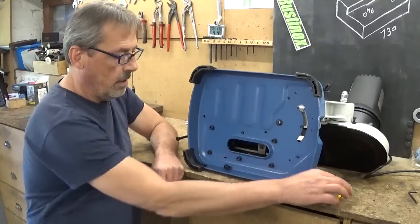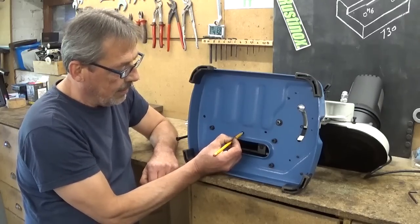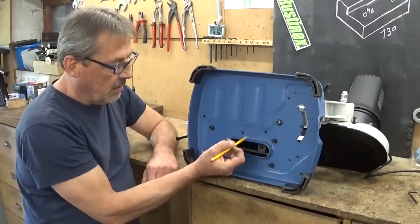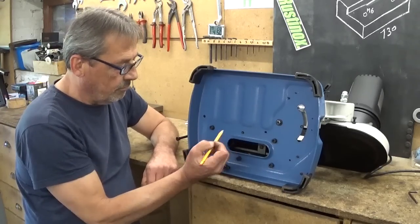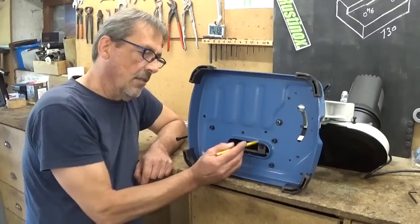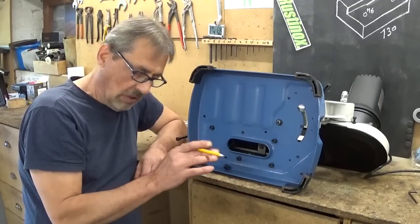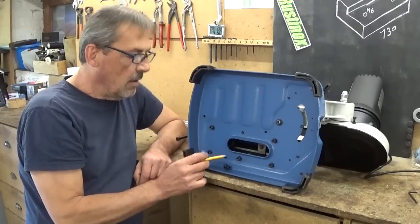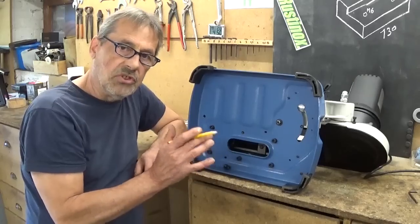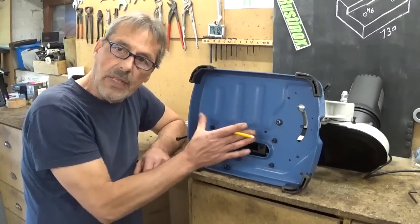So it means that the new holes will be drilled at 10 and 10 at more or less here, 45 degrees. Right here. I think it must be possible. Of course, I have to re-drill also these locating pin holes, but that will work. Let's start first with making new jaws, and after I will see if I will replace the vise or not.